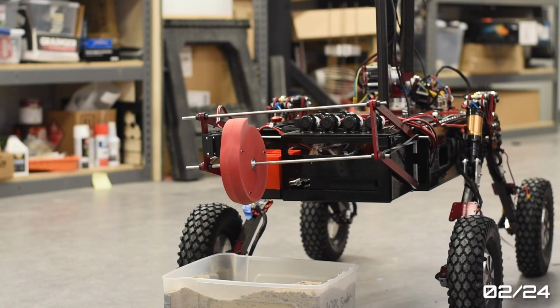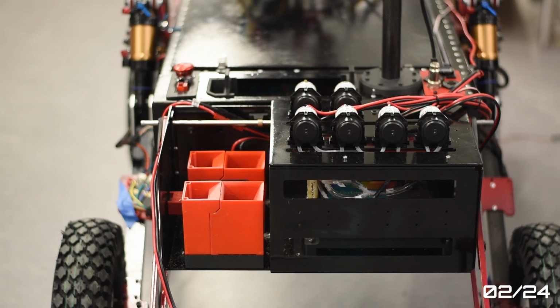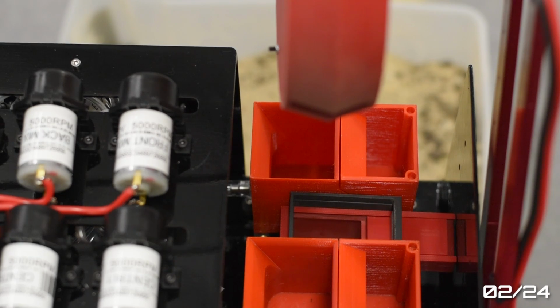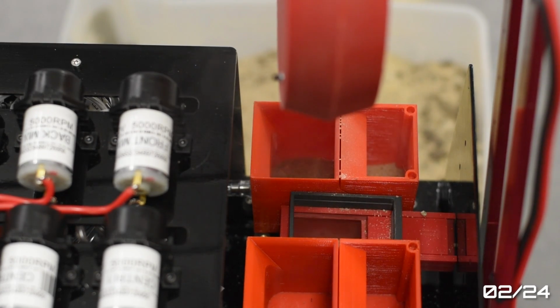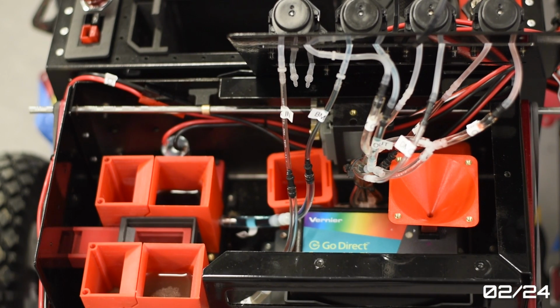The Astrotech sub-team is focused on creating a life-detecting science array to analyze our samples on the rover. The soil collection system features a 4-bar linkage to raise and lower a scoop to each site. Each soil sample is then separated into different chambers. One part is sealed dry to deliver to judges, while another part is mixed with low-concentration acid, which would react with fossil carbonates if present. The rest of the soil is combined with a neutral solvent, filtered, and pumped into a cuvette for analysis in our onboard spectrometer.